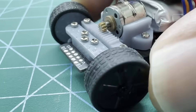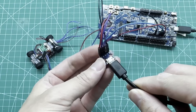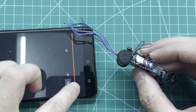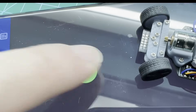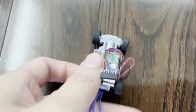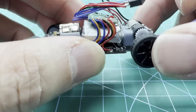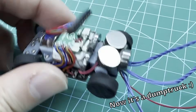Over four months of work, and it's finally assembled. I made a connector to interface with the programmer and the USB for communication and charging the battery. Back motor looks good, front steering works, and the command line interface is functional. It's time for our first test drive. Why is our tiny Cybertruck going in circles, even with the steering on the opposite side? There's not enough weight on the back wheels. Good thing I have some tungsten weights, and we can place them in the back area.